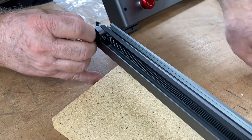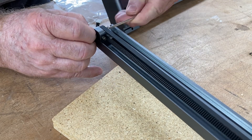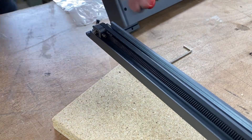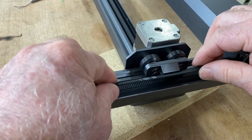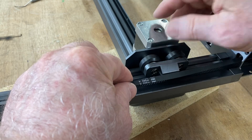I have a rough tension now on the belt and I'm going to tighten it into position. Keep in mind, this is not the final tension of the belt, but it is tight enough so it's not going to fall off, and I can finish the assembly. The last part is to attach this gantry — no more feeding belts around wheels and over sprockets.